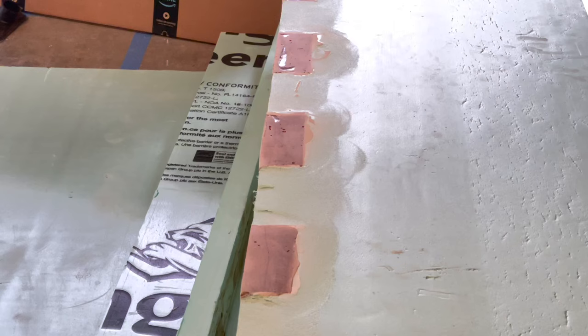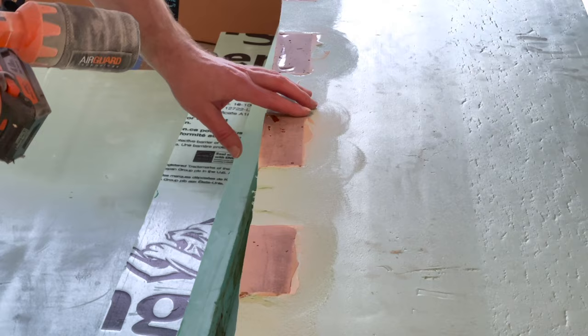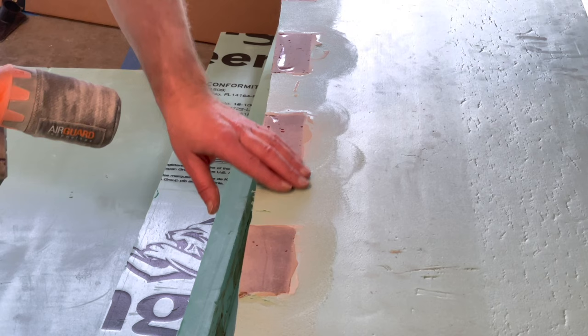Now, once all the seams were epoxied together, I used a little bit of epoxy along with some wood flour mixed into it, which is why you see it as a brown color once it dries. I basically use that to fill up any voids or gaps between where they're glued together initially, because no matter how hard I tried, there were still a few gaps here and there. So basically what I did was just do a very shallow pour and then went back across with a sander and sanded everything down smooth, at least as smooth as I possibly could,